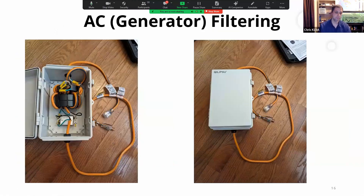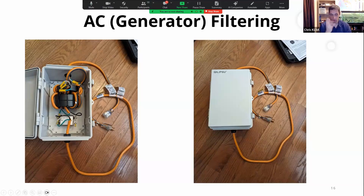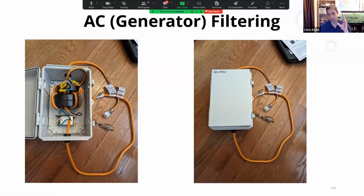I installed these filters. GM3SEK has a really cool website where he talks about filtering. I built these with parts on hand. This is a $12 EMI filter from Amazon — guys say it's not necessary, but I figured it couldn't hurt. I think these are Mix 43 ferrite cores, four inches in diameter. The number of turns is in the K9YC choke cookbook. This plugs into my generator — the 120V version. I also have a 240V version. It takes the noise from S9 plus 20 on 160 down to nothing — just atmospheric. Very important not just for generator but also for actual AC mains.